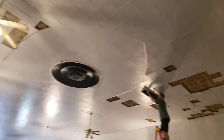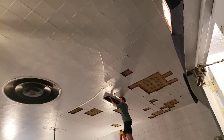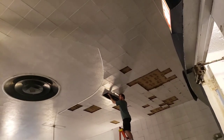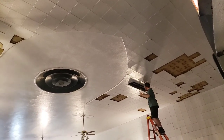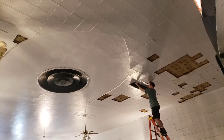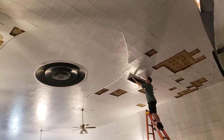The only way I would endorse it is if any ones where the fixture wasn't intact, use LED tubes and maybe keep a few of them preheat if you can make the color temperature close enough that you can't tell which is which once they're powered on. But I don't think I'd energize 26, you know, almost an amp ballasts in here.